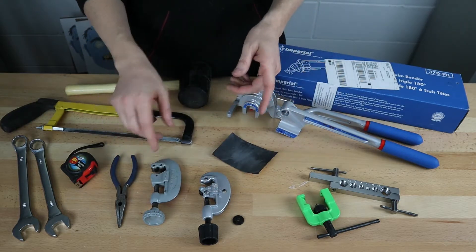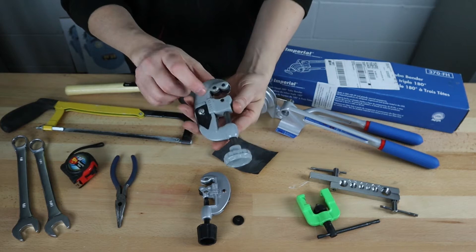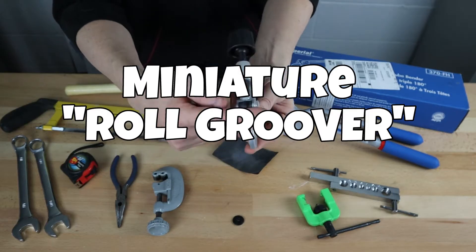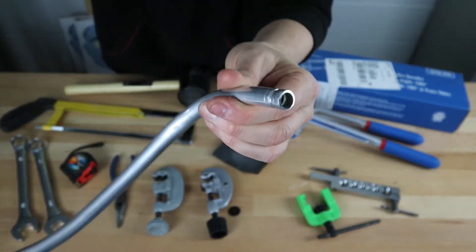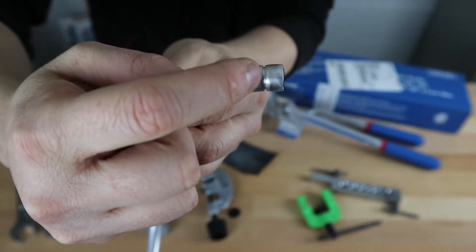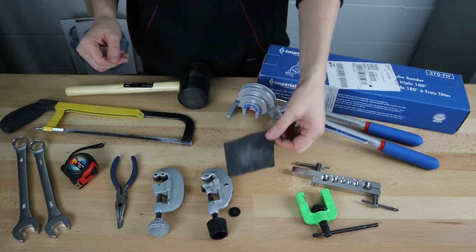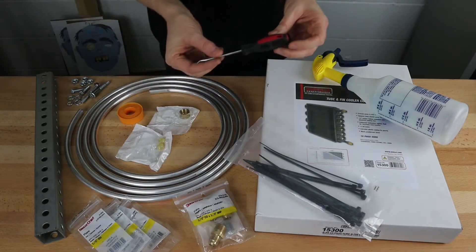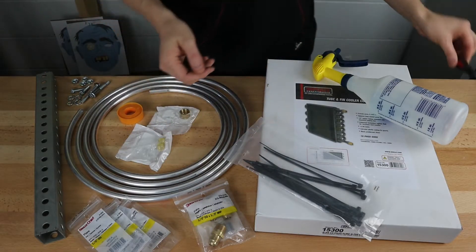Two pipe cutters — you don't need two, but I'll show you what I did with one of them. I left one as a pipe cutter. However, with the other one I took the cutting wheel out and put a couple of washers in there in order to make something a lot of people have been struggling to find online — I'll tell you about that notch when we go over how to make it. Flaring tool — that's going to create the taper for your pipes and fittings. A little bit of wet-dry sandpaper to take out sharp edges once you make your cuts. And a pick — I forgot about that tool. I'll show you how to use the pick momentarily.